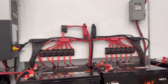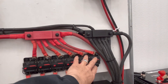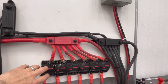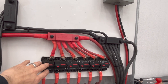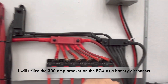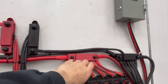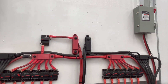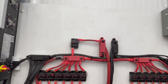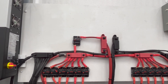A couple of my subscribers had some suggestions and I definitely took them to heart. What I'm going to do is replace all of these — not use disconnects — and just have T-class fuses all the way across, connecting each one up with T-class. My bus bars I'm going to upgrade again. I'm thinking I might actually make some — get a thick copper plate and build something that will handle at least a thousand amps going through it. Still figuring that out, but that's something I'm thinking of.